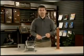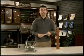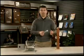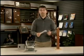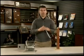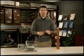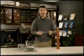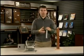Typically inside of a standard pin tumbler lock, you've only got one point of locking, which is the tumbler pins. That can be easily defeated with kinetic energy by slamming something into those pins and separating them. High security locks use multiple points of locking — not only do the pins have to separate, but they also have to rotate in order to interact with a sidebar mechanism, a slider mechanism, and several other things in order to unlock all at the same time.